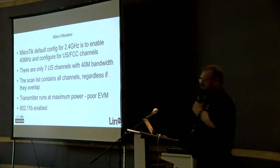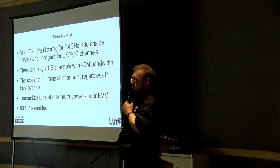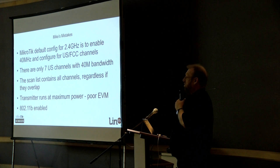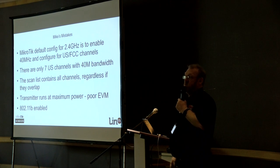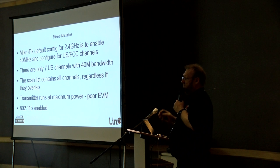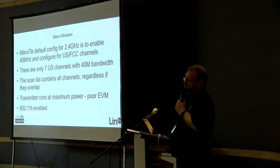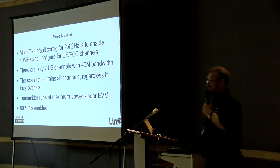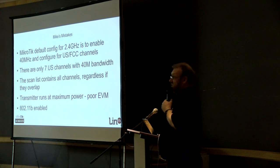He also hasn't reduced the transmitter power — it's running to the American standard, which allows something like 2 watts on 2.4 GHz. You'll never get a client to talk back to the AP at those power levels. The MikroTik out of the box with factory default settings will run at full power, which actually causes some of the higher MCS data rates to get distorted and not perform as well. If you drop the wireless card transmit power by about 2 dB, things can suddenly improve dramatically. And it's not just MikroTik — many vendors have the same issue of running at full power.